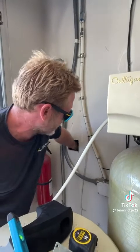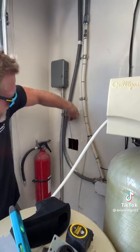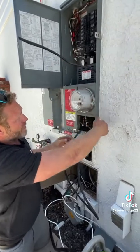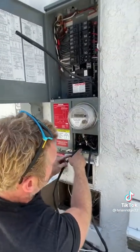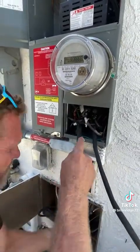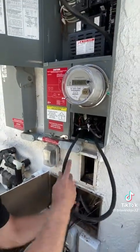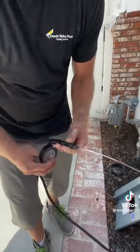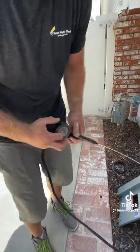On the side where I cut the box out, I can feel my snake is right here, so now I can tie the wire and pull it up. I ran the Romex down through the wireway, then installed the Romex connector inside the knockout. Now I'm pushing the wire down into this cavity and tying the wire to the snake so I can pull it back to the outlet.